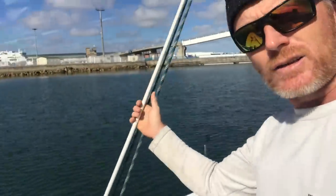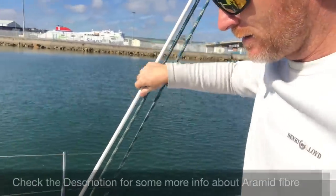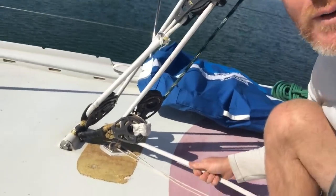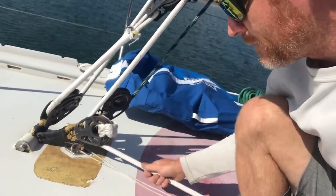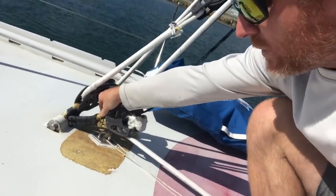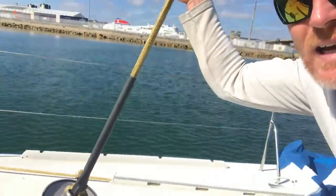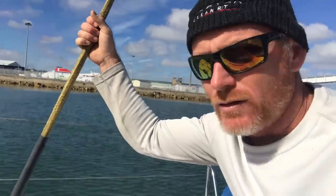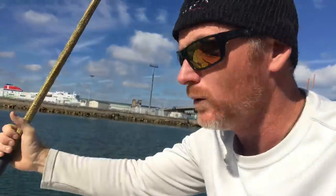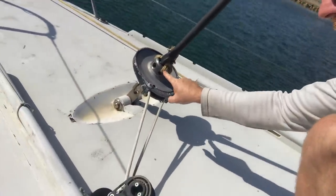In this situation, the line at the top here is PBO. This could be a Vectran rope sheathed inside Technora. Down here, Vectran is being used as a lashing to hold the block down. Over here more clearly, this is one of the forestays — the inner forestay — where the Solent, the big jib at the front, goes up and down with its furling gear at the bottom. It's lashed to the boat here with Vectran.